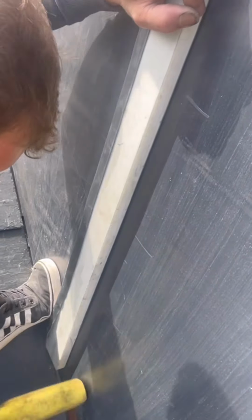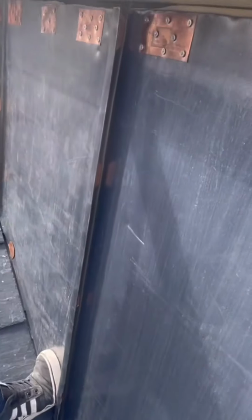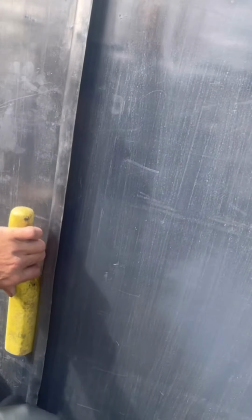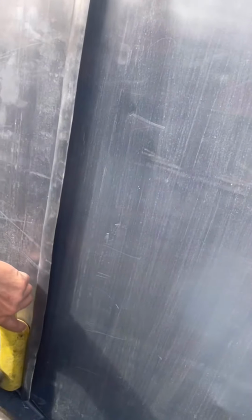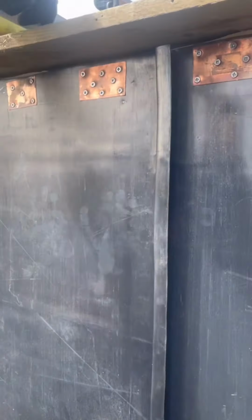You have to take your time. You can't just dress it round once as hard as you want. I hope that it's going to be right, because it will just pull out from this side. So work it back again. Little dress down there, keeping everything as straight as possible. As soon as you start to bend that first welt, you'll start to affect your second welt, and it'll get very frustrating.